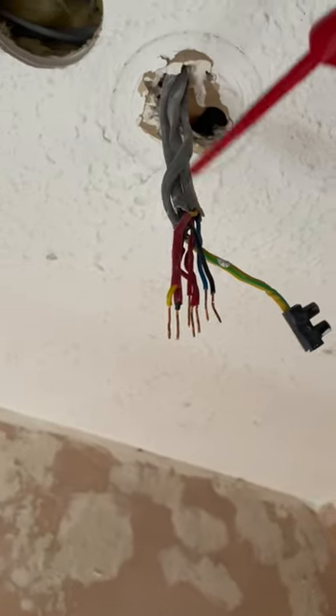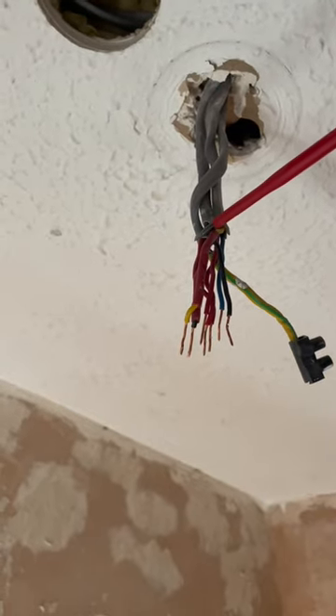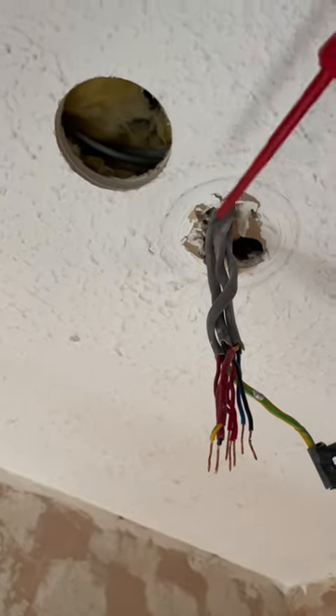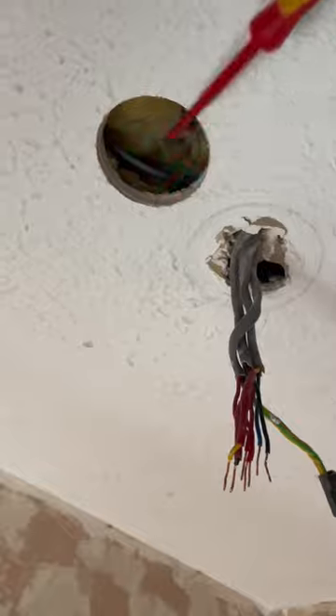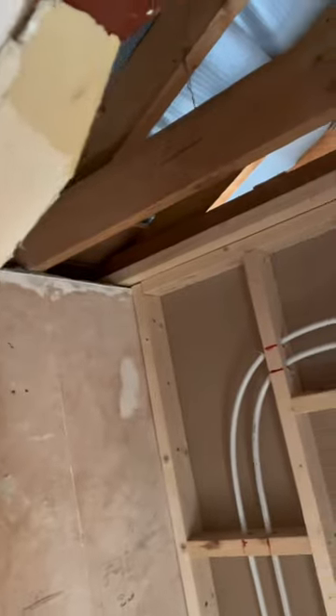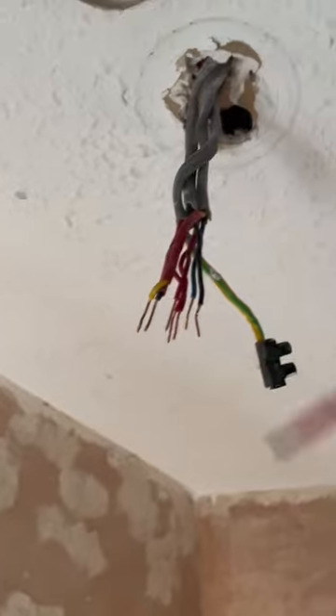I'll do a new three-core and a new two-core to daisy chain off for this one. I've got a box I'm going to put all this in, and then I'll have a light and feed the switch light out into this column wood. From here I'll rod back up along and come along and put it down right there, leaving it ready for a six. Just figuring out this run of wires around.